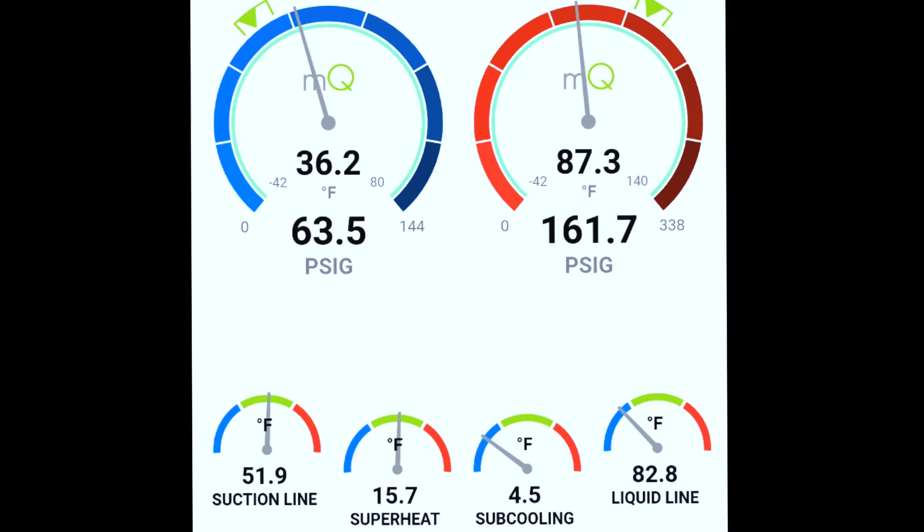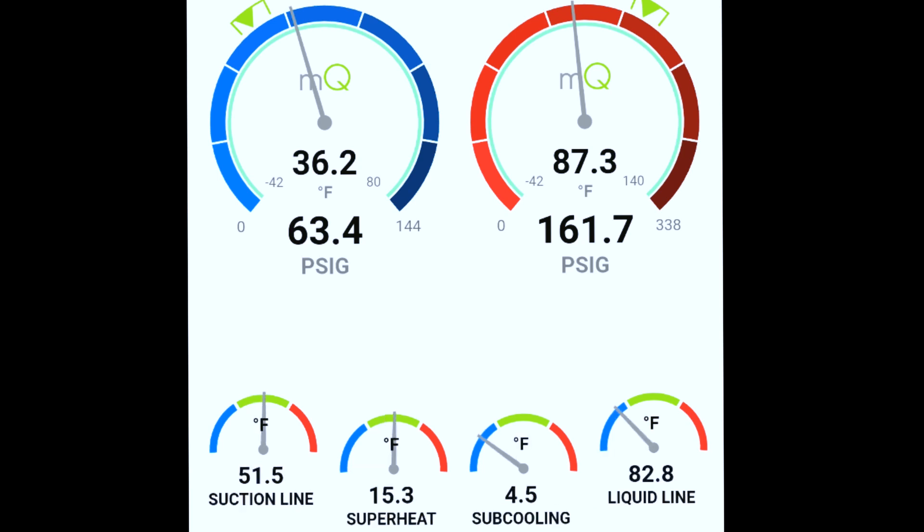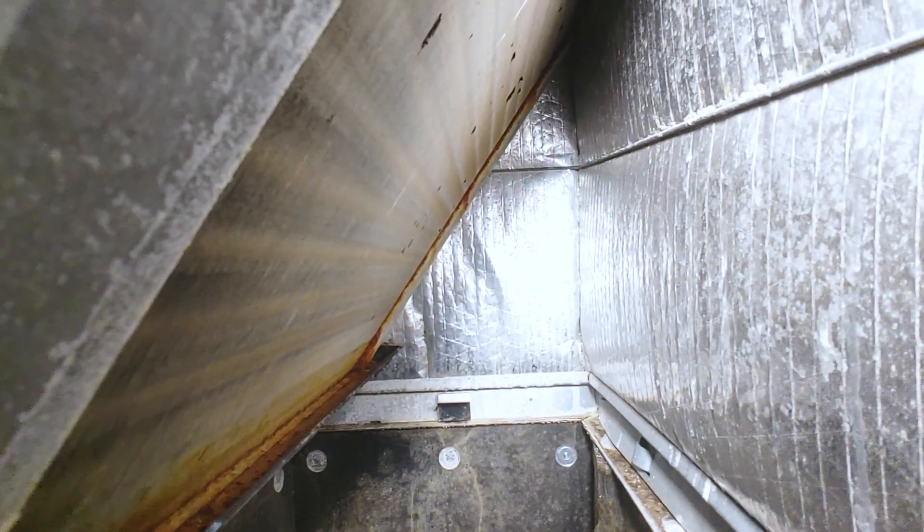Now that we've got the sensing bulb properly connected to the line, you can see it's metering refrigerant. And if you remember what that coil looked like — it's more than likely going to be that indoor coil. It's R-22. With that platform being wet down there, it's got all the classic symptoms of undercharge — see the coil dripping water, dry spots, dripping into the pan instead of this pan here. That coil is definitely shot.